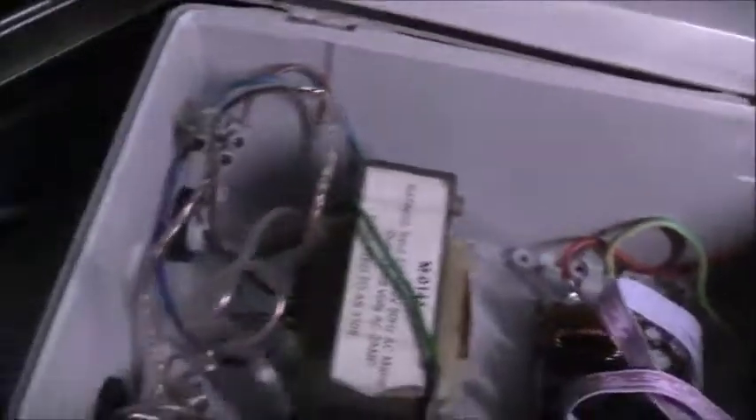All this smoke came out. I let the magic smoke demons out of this one. I just cut the rectifier out of the circuit, and the primary is okay, but the secondary got a bit too overloaded, and that did not last more than 5 minutes.